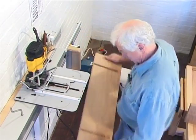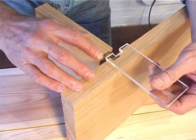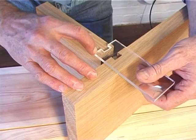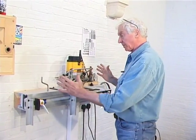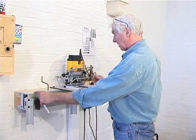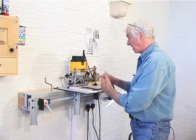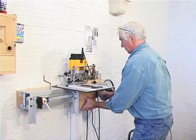Let's look at the sliding tenon. We need to go back to the tenoning technique. We need to make a joint in the top of the uprights to fit the dovetail slot in the bench seat piece. We know that the joint must be the same size as the cutter. Its depth was given by the acrylic strip, and we haven't changed it. At the beginning of all this, we had the east-west registration with the cutter and the mark and the 2 fixed fences. Now, we can move this around to act north-south if we have the cutter and the wood brought together.